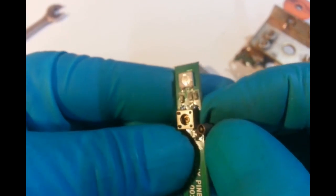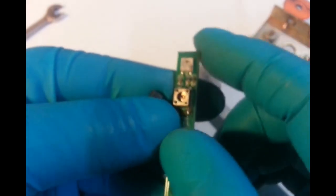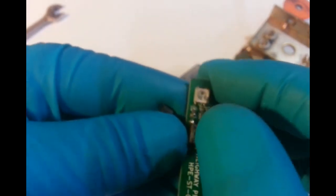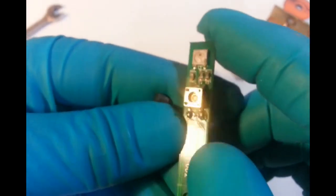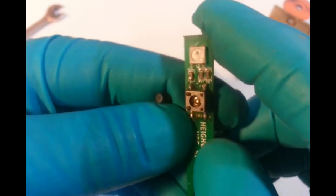The amount of force. It's meant for a tactile finger switch with a straight rod pushing it where you push your button, and as we know, handle with a finger press. Not even a hard one, but in a straight line. These are getting pushed sideways, and the more it flexes, it pivots on it, it presses it, and then it pivots on it. It doesn't actually just push it straight. So what it's rated for on paper, but it's having other things done to it.